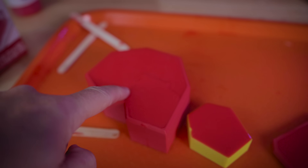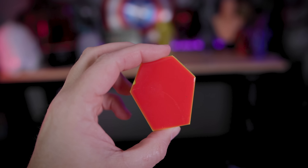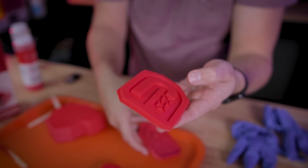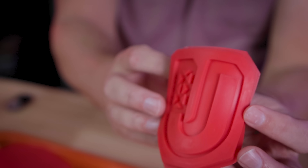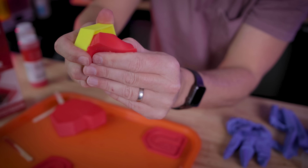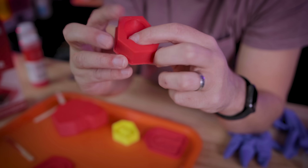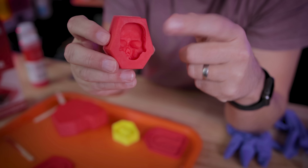It's been 24 hours and the silicone I poured inside my 3D printed mold boxes has fully cured — it's nice and stiff on all three molds. Let's see about getting these de-molded. It's peeling out — this is looking clean. That is so satisfying to peel away. It's really clean looking, I am so impressed with how smooth this turned out. Even though I was printing at a really fine 0.1 millimeter layer height, you can still see some striation marks from the print on the actual silicone mold.